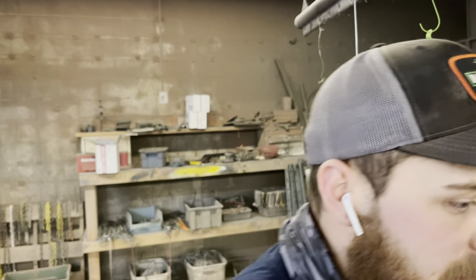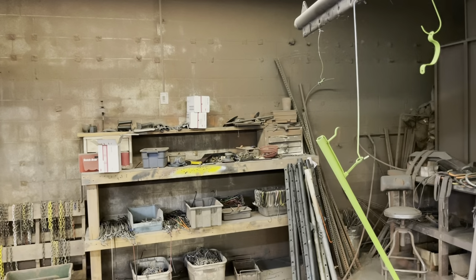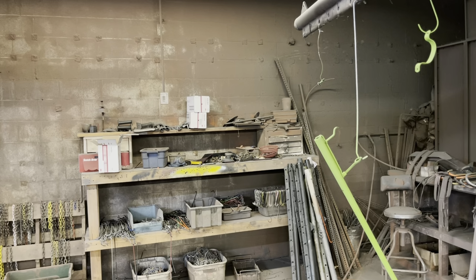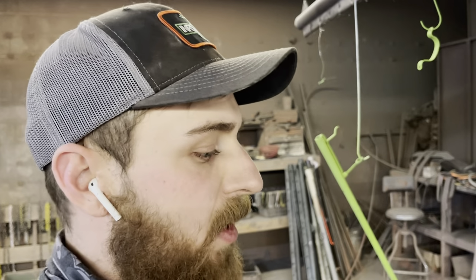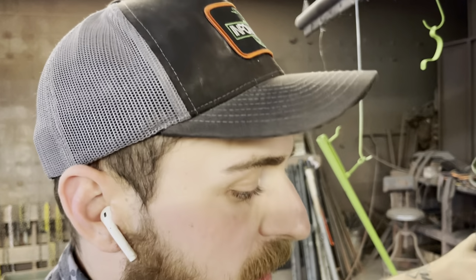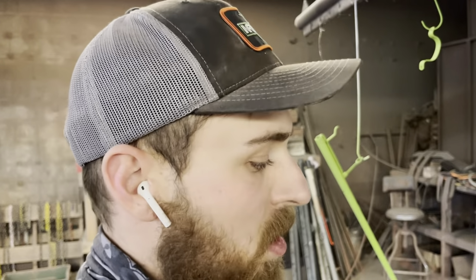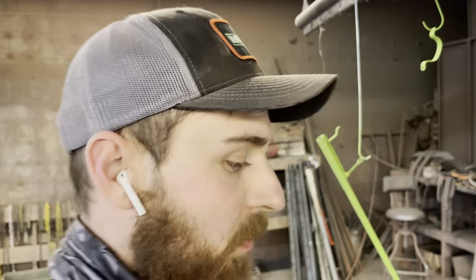So now cleaning out the gun right away, first thing I'll do is just throw some acetone in the gun or wipe out. Take my rag, stick it down in here, and wipe a lot of that Cerakote out to start with, alcohol on your rag. Cerakote is extremely sticky. It chews up air guns. I went through a few.